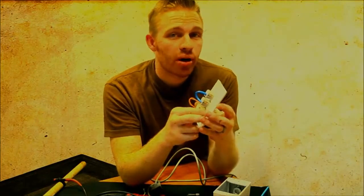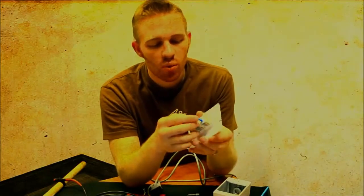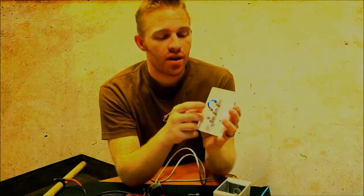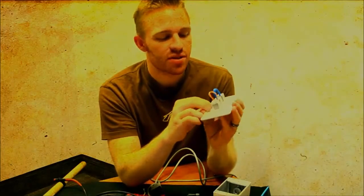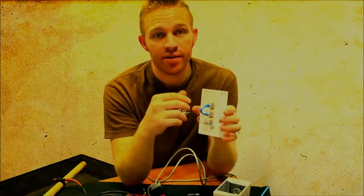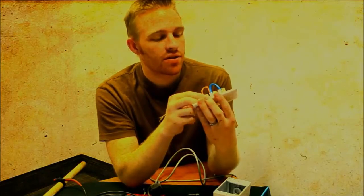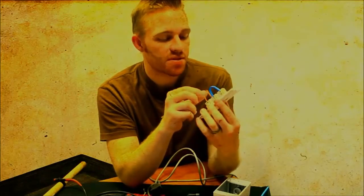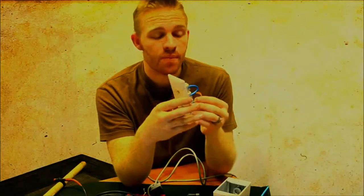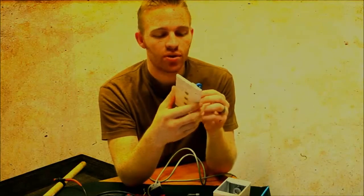You already have a brown-white wire heading to the SeaPerch which isn't being used. Up here, I've wired the controller port straight to the ROV port, and I went ahead and wired all the wires exactly the same on one side as on the other — that way it's just a direct connection. Next, I wired the serial cable port to the SeaPerch port. Since the brown and brown-white terminals weren't being used by the controller, I went ahead and just tapped right into this port, and that enabled the serial port.